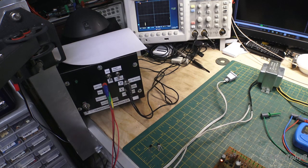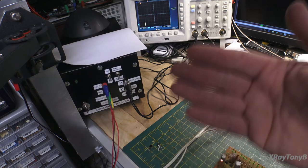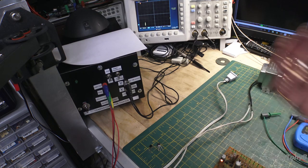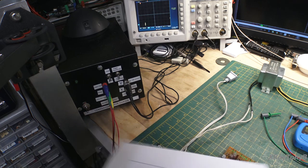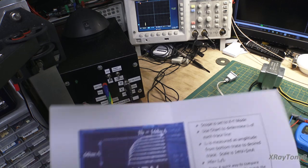And what a curve tracer does is it applies a set series of stepped currents onto the transistor, and then it reads out the output. So if you have a set base current, then it will read the output collector emitter current, and then by dividing those out, you can come up with the actual forward current gain of the transistor at different steps, which is really important.